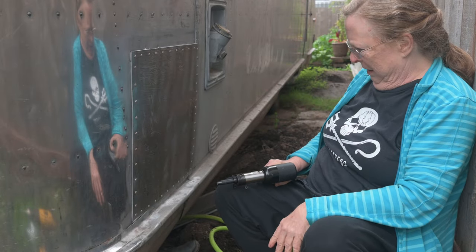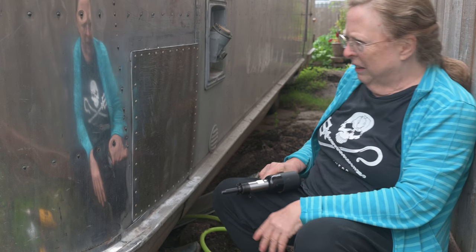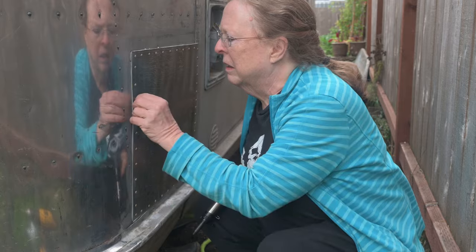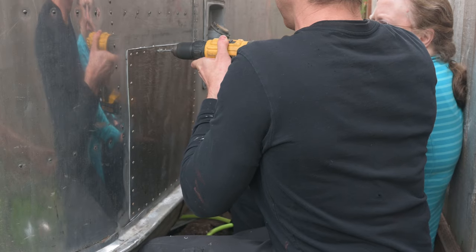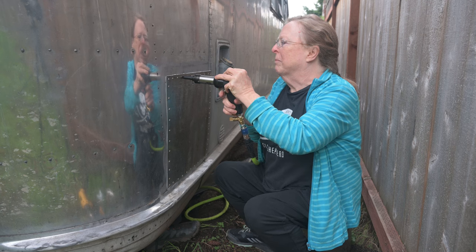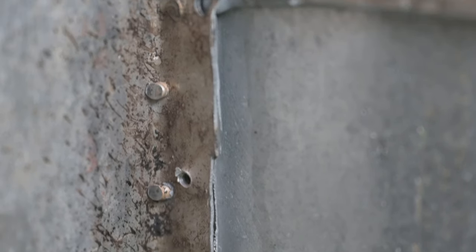How's it look? This looks good in here. I don't see any holes. Those rivets almost have no shop head in here, so I might drill those out quickly. And here's how it looks from the inside, and a close up of some of the rivets.